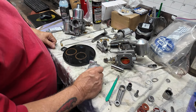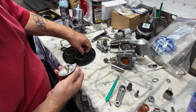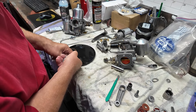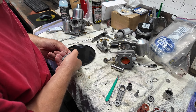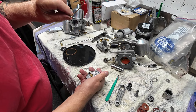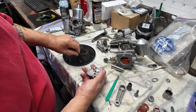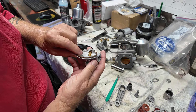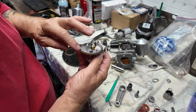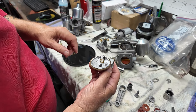One little trick that I have always done — and you guys can do it or ignore it. These seals are normally very tight and they will break if you put them on dry. I just soak them in water for a little while, then they fit on nicely, and just leave them there and they will shrink back and there'll be a good seal.